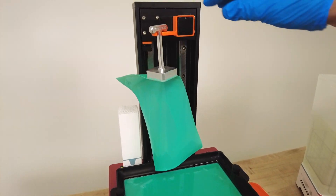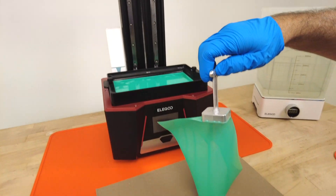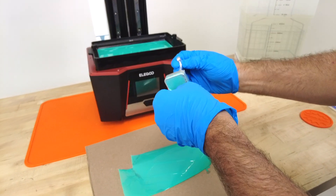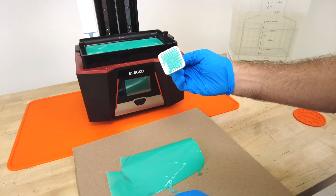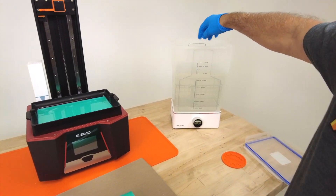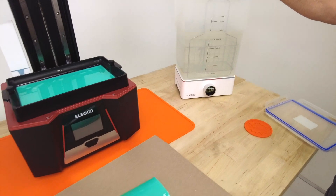Once it's sufficiently drip dried, you could just remove it. We like to add a little piece of cardboard or some kind of a tray to catch the drips. Then you could remove the hardened resin. If anything stays in the grooves, don't worry about it — leave it in IPA overnight and it's just going to flake right off because it hasn't been completely cured. Drop it in the cleaning station, come back in a couple of hours, and just peel off the bottom.